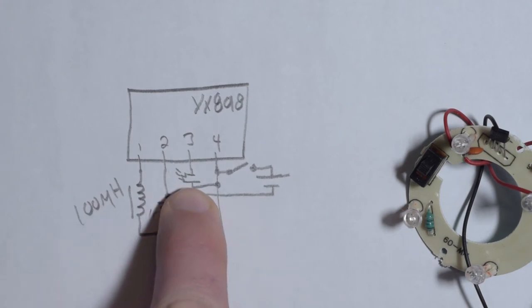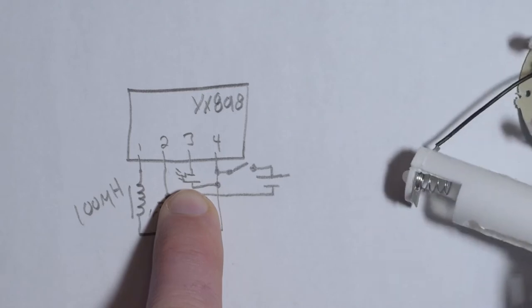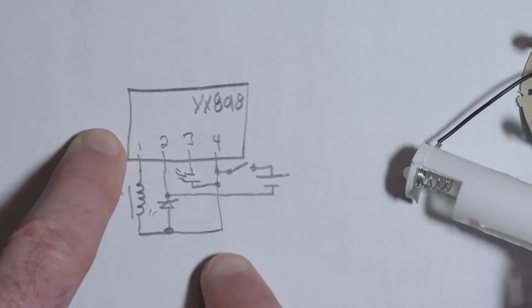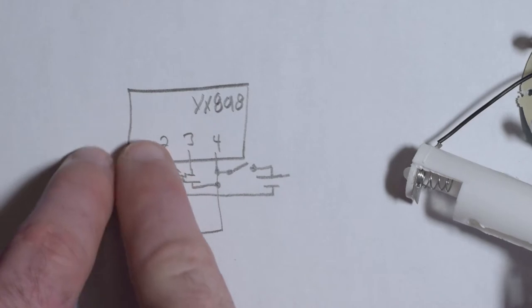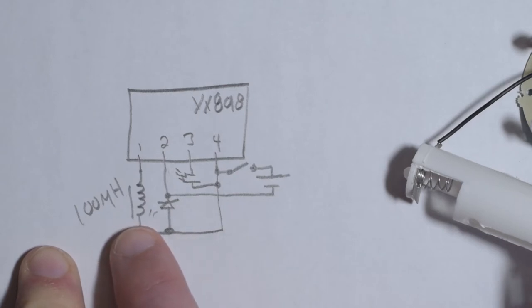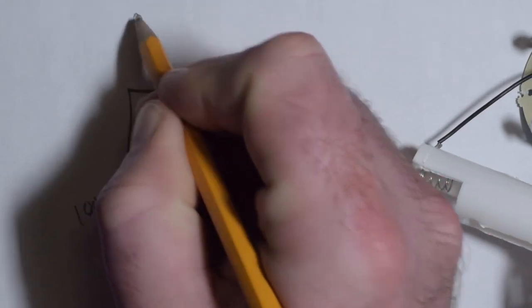This is the solar panel here. In this case, they use a bunch of solar panels in series, like we saw. There's our LEDs and the inductor. Now what must happen here is it must use the same inductor. There must be a set of diodes in there where the inductor gets charged one way and then back the other. Because the only way for a Joule Thief to function is with a transformer with two sides. So basically, it's a center tapped transformer.